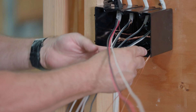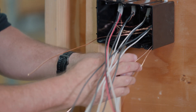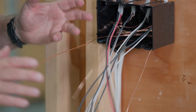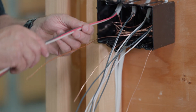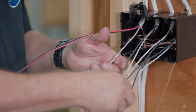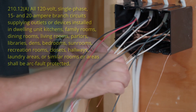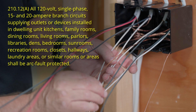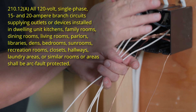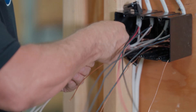Now that it's in the back of the box, we can get our ground wires and push them to the position of each switch so that each switch has its own ground wire. Next, we're going to handle the grounded or neutral conductors. In residential these are typically grounded conductors because you don't usually have multi-wire circuits as much since everything is arc fault. We're going to take these grounded conductors, making sure they're not twisted up on any of the hot conductors, and push them to the left side of the box.